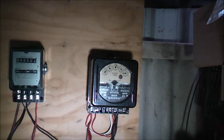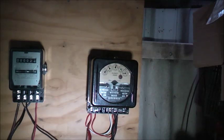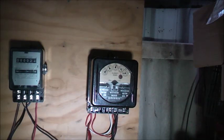Polyphasing was very common back then — mainly for floor heating and hot water services, and stoves in particular. All required 2 phases. Even old welders required 2 phases. Many old welders are probably polyphase as well. Whatever you use in a shop or a farm — most likely a farm or a shop, this meter. Farms typically had houses with 2 phases, and the rest would have led to a 3-phase meter separately, which nowadays they use a 3-phase meter for everything. But back then they didn't take the meter out — they left that original meter there and put a single phase alongside it.